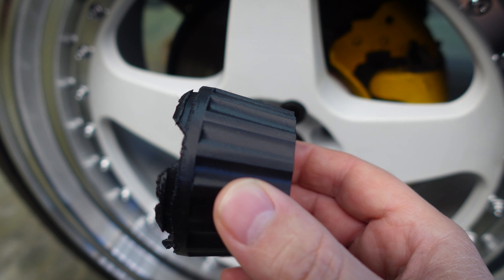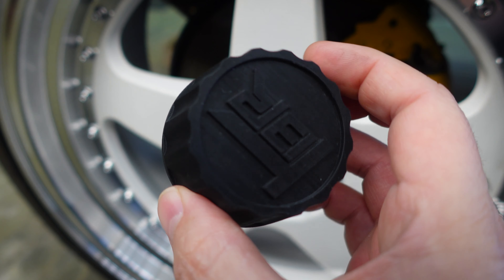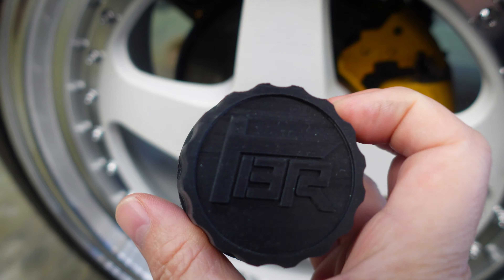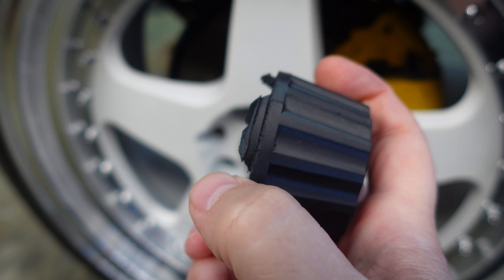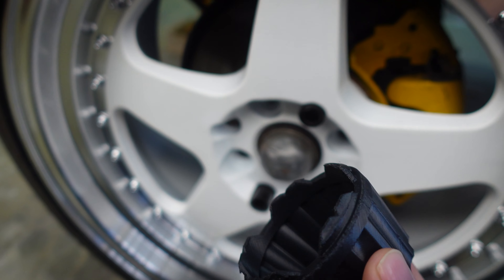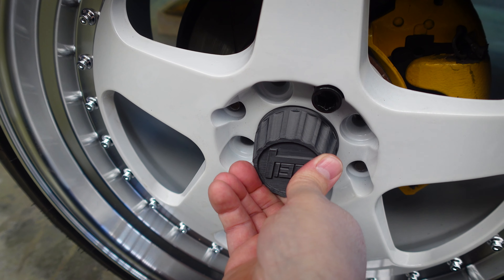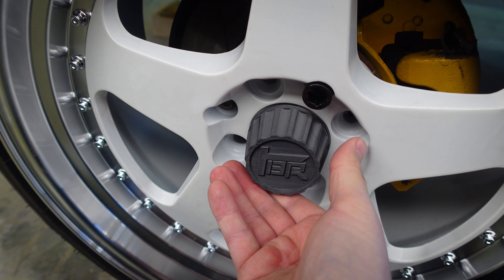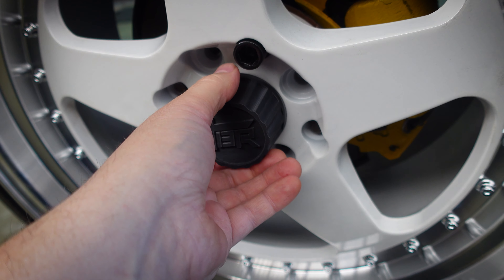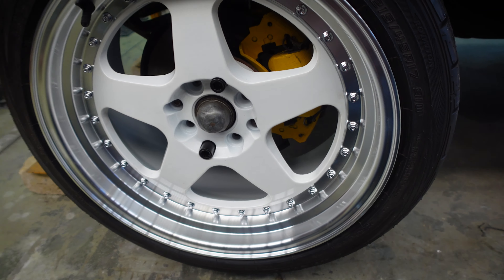The final version exceeds all my expectations for a straight-off-the-printer part. I love the TBR logo and the grain effect, and the tabs are really quite robust. They don't fit on the front yet, but one fitted on the back wheel. I'm thinking the solution is to machine down the lip on the dust cap — sand or machine about 4-5mm in and a couple of mm down — just to get that clearance.